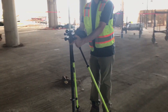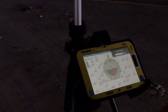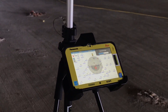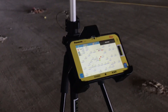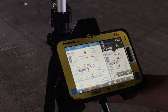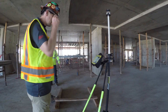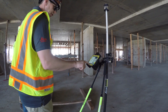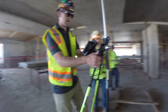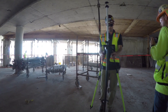The prism lost us while walking, so we're going to go up to the top and go to move and search, and select to the right. It's going to spin over and lock on us right away. The one button we need to remember to hit in this case is the Start button, because if we move, the information is not updating on the screen — so you want to hit Start. It does update and it'll center you on the screen so you can see where you're going. The point is right behind us, about 15 feet, so we'll walk back until we get to that location.